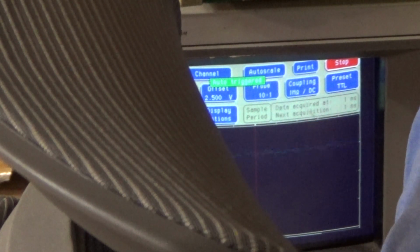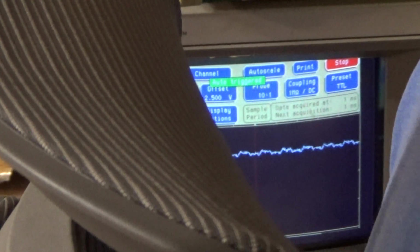Alright, I think it might not be RAM addressing, we might have a problem with just regular old addressing out of the CPU, because it should be accessing this ROM, the 0 ROM, H ROM if you will, and it's not. Yeah, this should be going low. And this one is being accessed. Why is this being accessed?